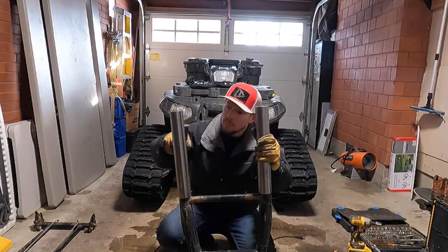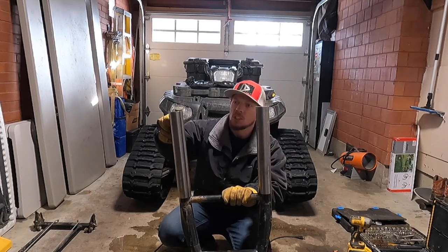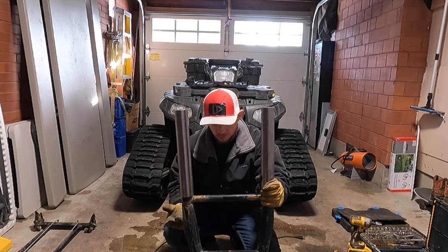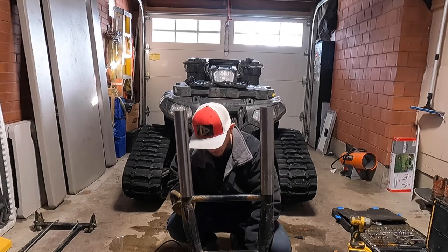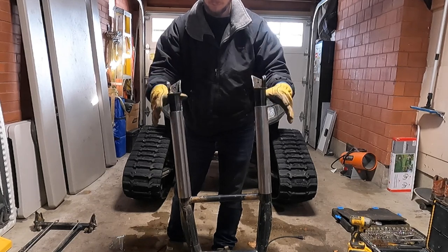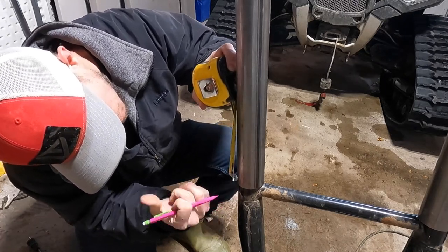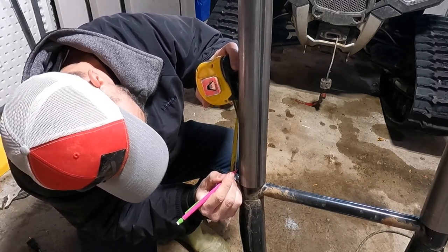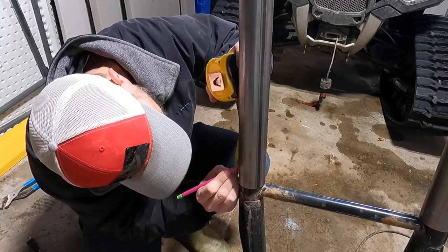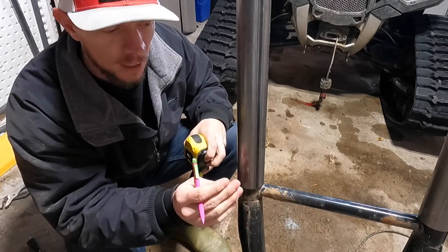You might be thinking this is bigger than nine inches, but I accounted for roughly two inches on each end that I'm going to be bolting through — so they really had to be a little bit longer than just nine inches, but that'll give me overall nine inches. Now we're going to drill holes here and then here through these, then paint them up and call it good. I know I'm two inches in, so roughly my pipe ends here — I'm going to go one inch in and that'll be where I drill my hole.